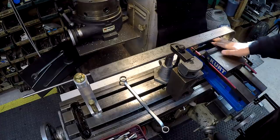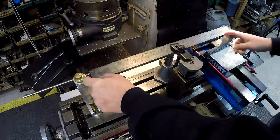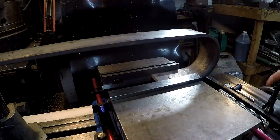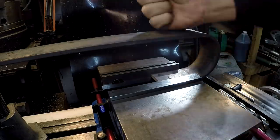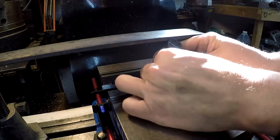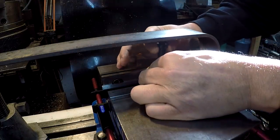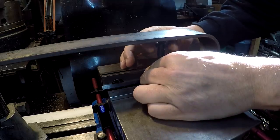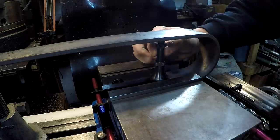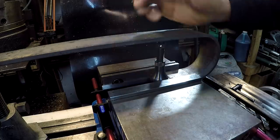So we've got good clamping area right here. We've got our planer jack there. We're up against our stop. So we will position our pointer right there on our scribe line. Now we'll add a little bit more stability right in here because this is still going to try to move around a little bit. We'll use our Starrett Little Giant. Come right up in here and just apply, finger tight here to the screw. Just like that, and that'll keep this from trying to squeeze down and keep them together there.